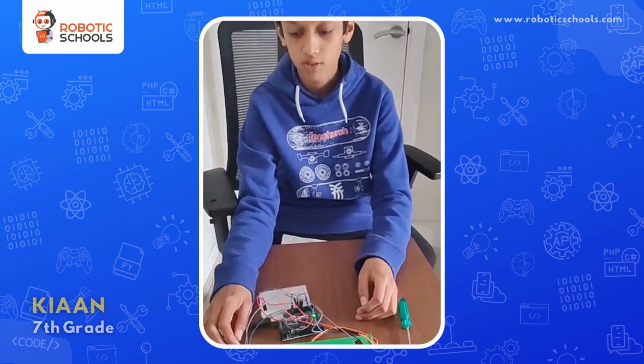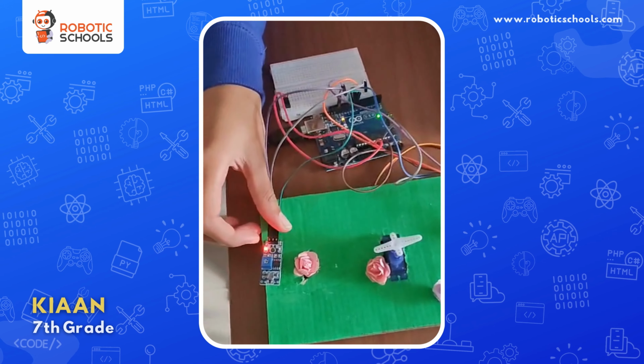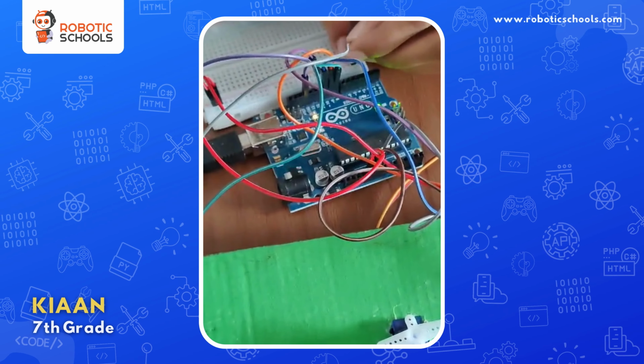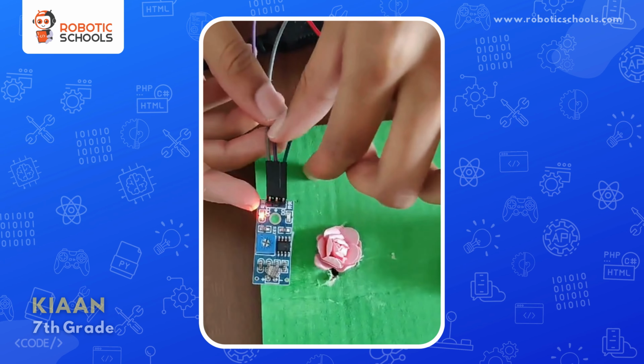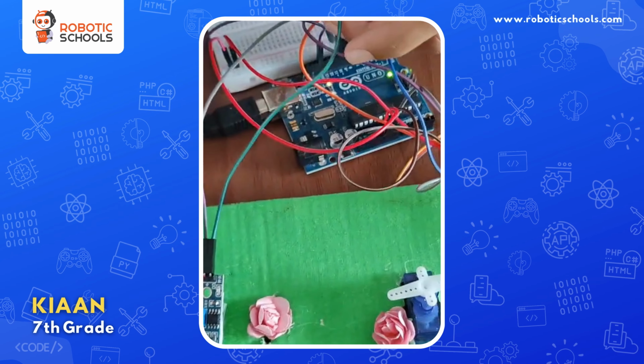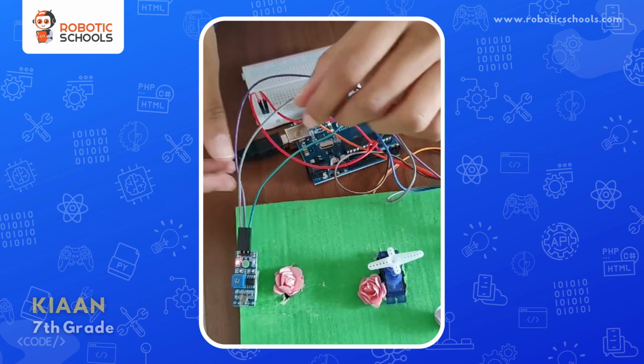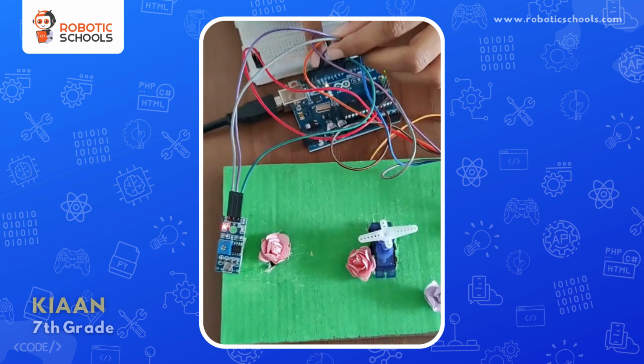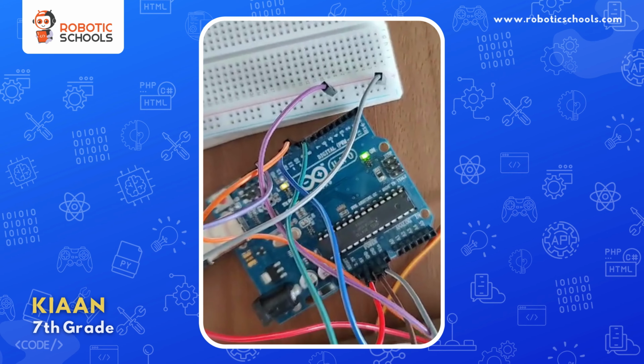Here is my physical part of the project. For the LDR sensor, the VCC pin connects to the 5 volts. The DO connects to the signal pin. The middle pin connects to the GND. Let's start.